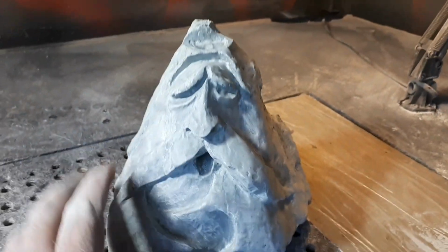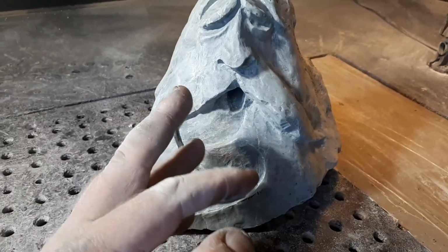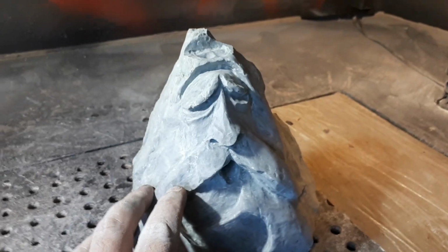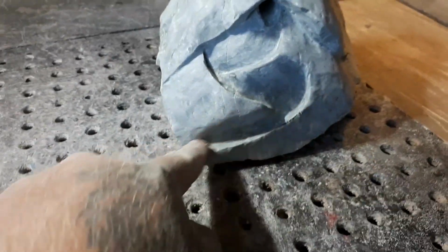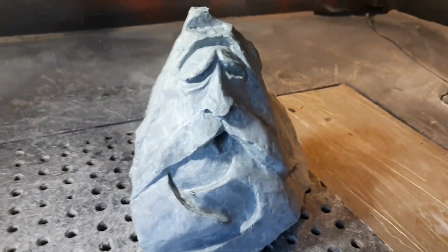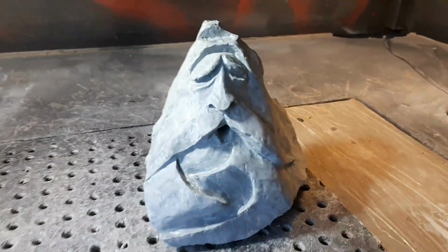But what I'm gonna do is blow it off and then spray it with some of that Rust-Oleum stuff that the home handyman uses. So I'm not gonna use beeswax on this, because if you use beeswax, when this gets hot, the smoke might be warm out here, it's just gonna melt the wax. You know what I mean? So it's gonna be dull here where the smoke comes out. So I think epoxy spray is kind of good enough. Or lacquer spray, whatever, I don't know. Let me just go clean it up and spray it. Get the hell out of this room.